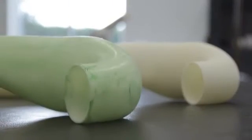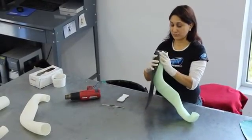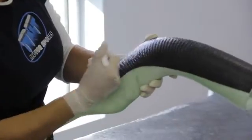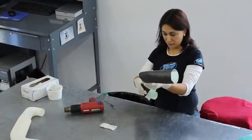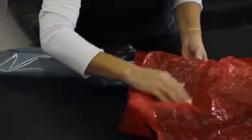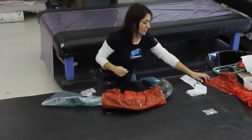After applying a sealer and release agent, the composite material is laid up or wound on the FDM core as would be done with traditional tooling. The uncured resin is either applied to the fabric beforehand in the case of pre-impregnated systems, or applied during the layup by hand or infused with the assistance of a vacuum pump. Next, the composite is consolidated using vacuum bagging, shrink tape, or other methods.